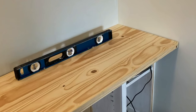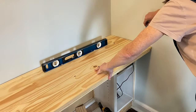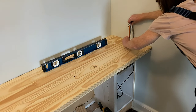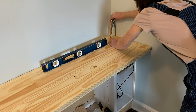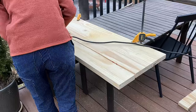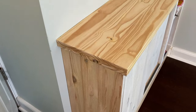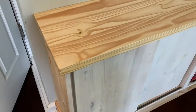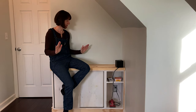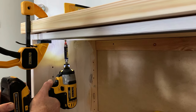Once the glue was dry, I removed the clamps and set the countertop on the cabinet base and checked the level. Nothing in my house is plumb, so to account for the not-so-90-degree corner, I used a scribe tool to mark where to cut my countertop so that it would fit against the wall with less gapping. Using a circular saw, I followed the line, then did the same process for the back — it was a perfect fit. Not pictured is wood filler along the seam and a whole lot of sanding. The countertop turned out way better than I was expecting. I did more leveling and shimming where necessary, then attached the top from the underside to prevent screw holes from showing.